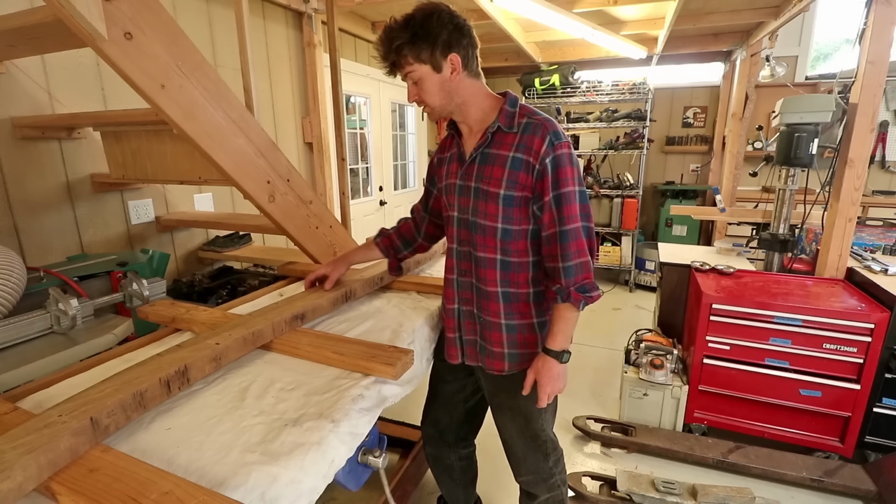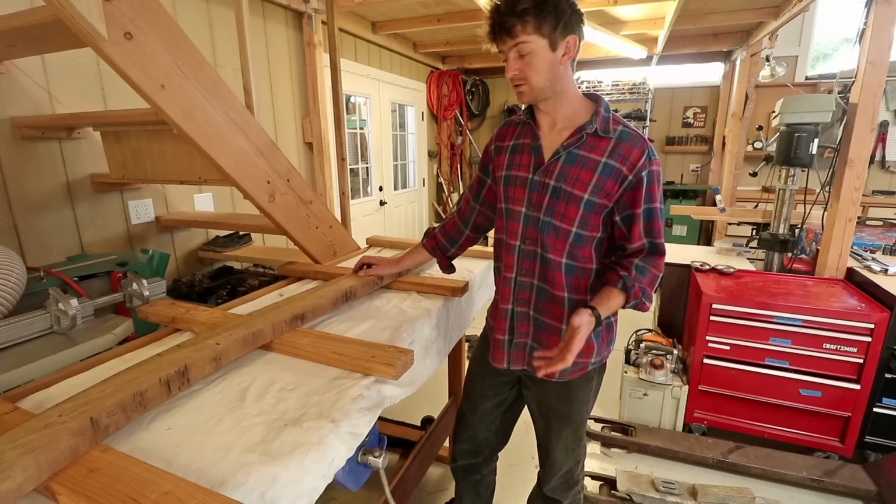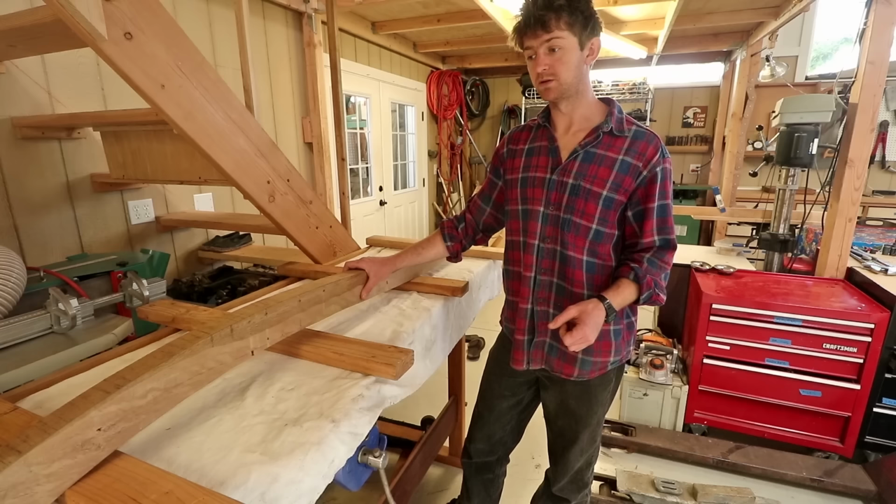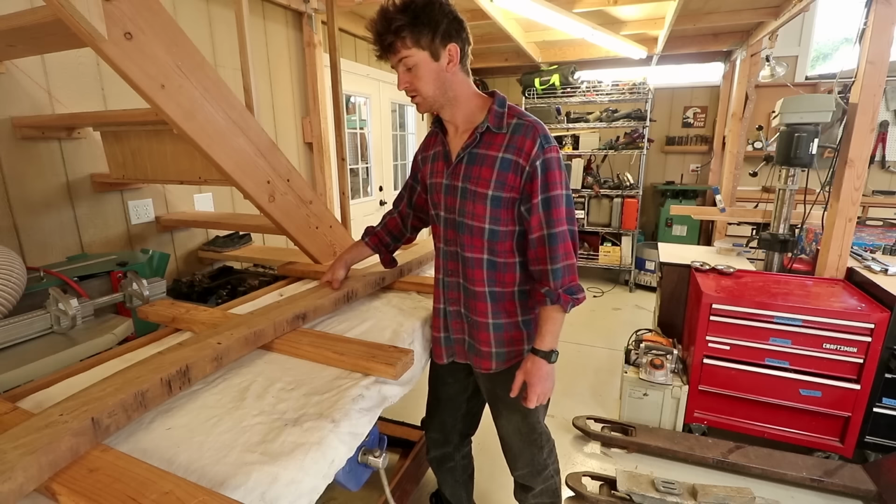Anyway, I would be reluctant to make a frame entirely out of this timber on the edge, but I have absolutely no problem with having parts of that on the edge of the frames, and it means I can get a lot more futtocks and a lot more usable timber out of the flitches that I've got. This does seem to me to be the consensus among boat builders who have used and are familiar with live oak, both in new boats and historically speaking.